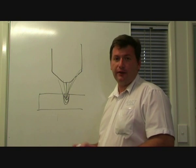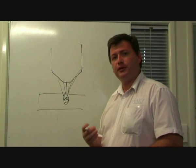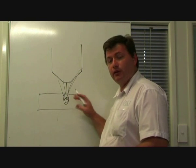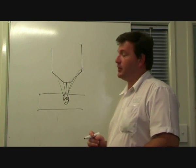This can take anywhere up to one and a half seconds on the thickest material, but most of your settings will generally be around 0.4 to 0.7 of a second. The main reason is, as you increase the thickness of the material, you also increase the power, and the pierce time still remains approximately the same.